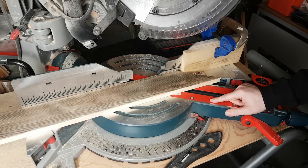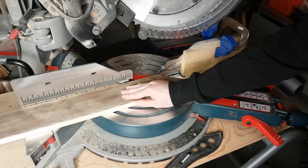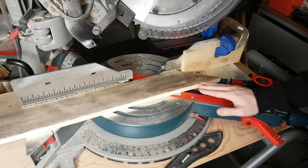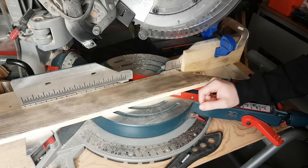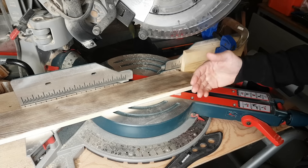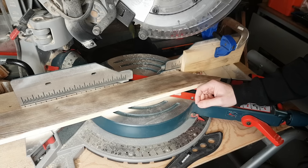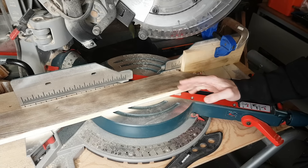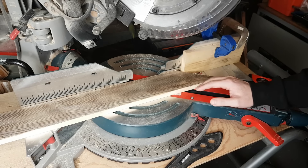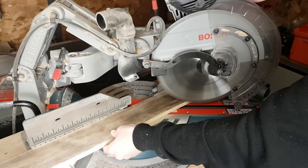To cut these pieces, it's very similar to the first three. We're going to go back to 54 degrees and start there. I'm using the same board as earlier — it's already cut at 54 degrees — and I'm going to cut it every 4 and a quarter inches to get four pieces. So 4¼ instead of the 6¼ earlier. If you're wondering why I keep adding that extra quarter, I just like to make everything a little bit too long so I've got more room for error. You could probably cut those first three pieces at 6 inches and this one at 4 inches to save wood, but to keep it safe I'd recommend 6¼ and 4¼.